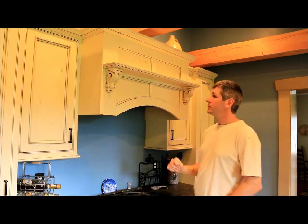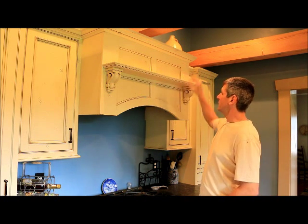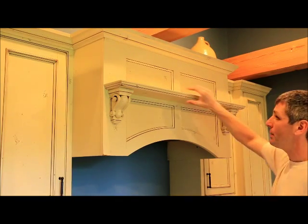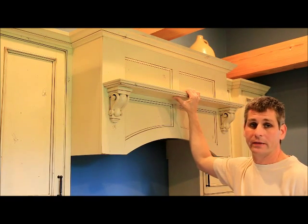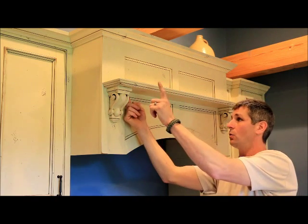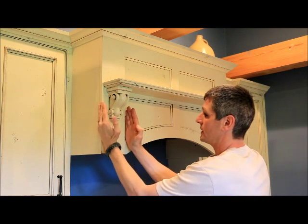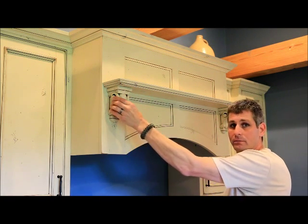The M-Series hood comes with a shelf or without. Without a shelf, it's going to have just one big panel on each side. As soon as you ask for the shelf, it's going to have this middle divider rail, and you can then order the appropriate corbels from the catalog. The shelf comes six and a quarter or six and a half inches wide, so you can fit a pretty good-sized corbel. You've got a six-inch space here and about a foot to fit it on, so you can fit a big corbel. We chose a little smaller one for this application.